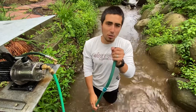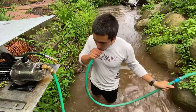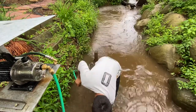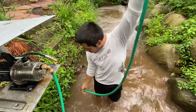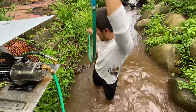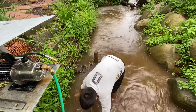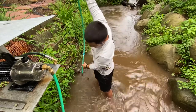I was blowing so no air can go in this way, but air can go in this way. So how to test this? I'll put water in here and it shouldn't come out here. It didn't come out. I'm not going to see it come out this way. And if I do it vice versa, it should allow the flow — yep, it flows that way.